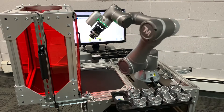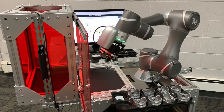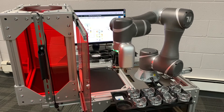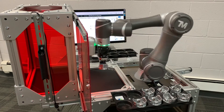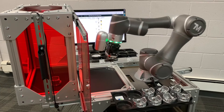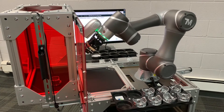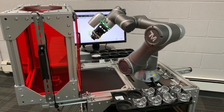These robots have a really cool feature called landmarking, and it's great for applications like these with machine tending. Landmarking is really important because it allows the operator to just put a tray of parts somewhere within the reach of the robot, and the landmark feature will allow the robot to reorientate itself and pick it no matter what the orientation.